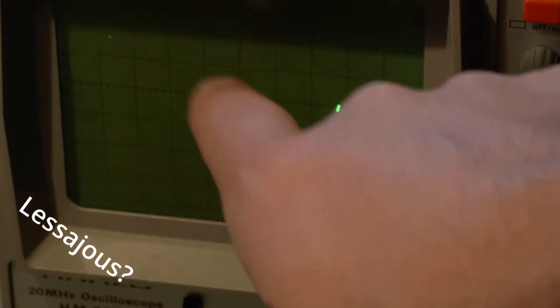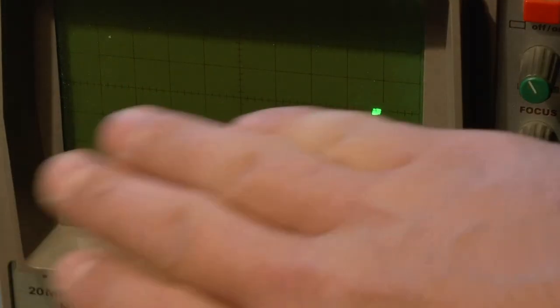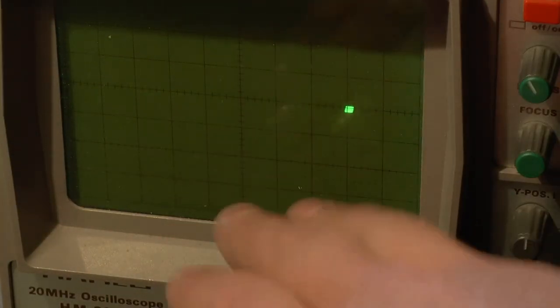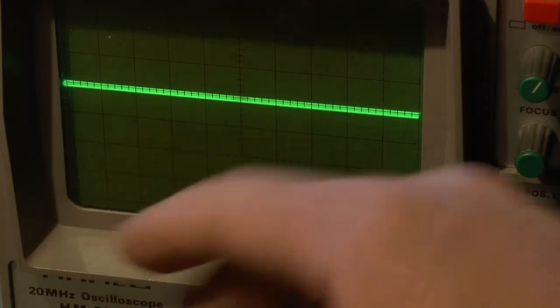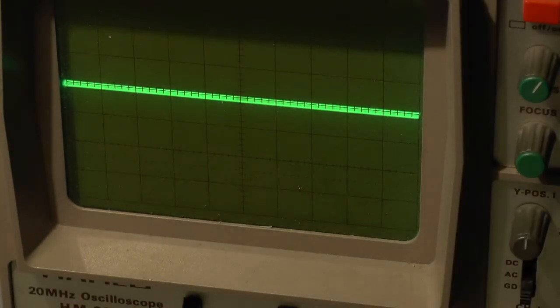With intensity on, you can just about make out it's drawing a little circle — one of those Lissajous patterns you get when X and Y are fed with a sine wave. So somewhere in here something got knocked loose and is now coupling in interference. The other thing is this is not present when the unit is cold. If you start it up, the trace is actually perfectly fine — smooth and sharp, without this weird interference pattern. I have no idea what that means yet, but it probably means something.